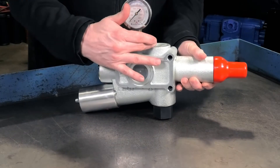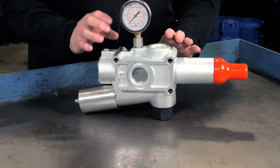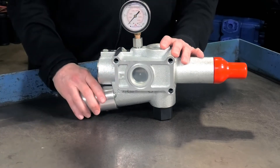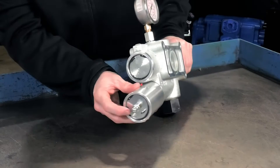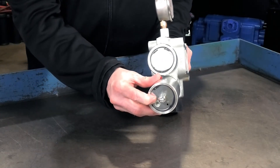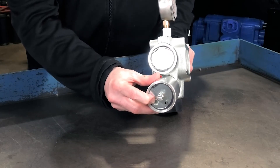The pressure line continues out to the back of the trailer. The pressure in that line is adjusted to the relief function of this valve back here, which is an air valve. On the back you'll notice a fitting — this comes from the line in the dash, the actuator for high and low. When it's depressed, this is where that line goes.